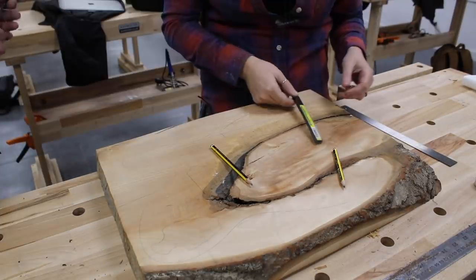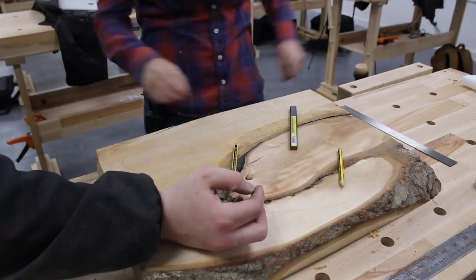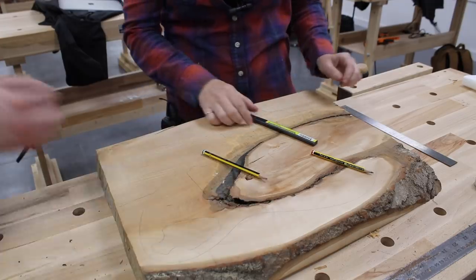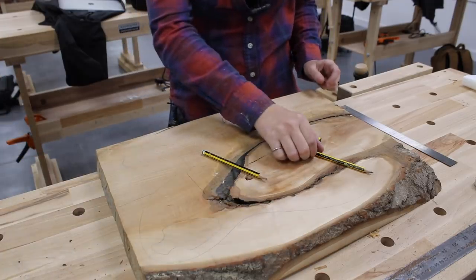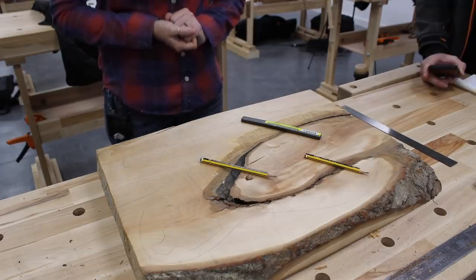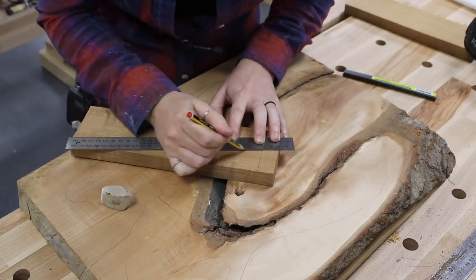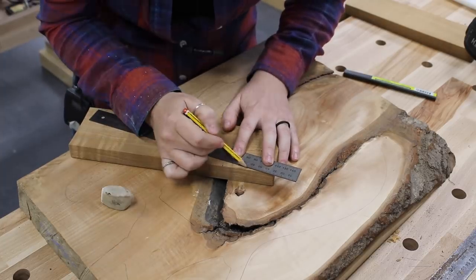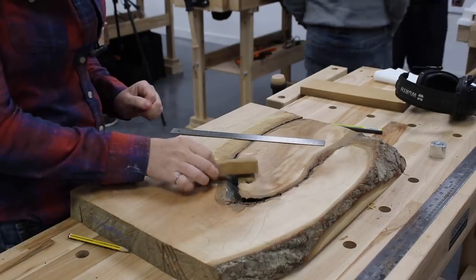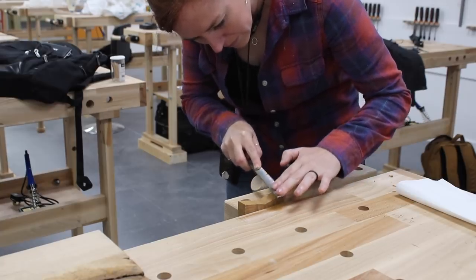After tracing on my body shape I roughly figured out where I could place the bow ties and how large they could be without interfering with any of the guitar components, but still in positions to do their job of holding together the crack. Once the direction and general size was sorted, I drew it out on a piece of roasted sycamore — the same wood as the neck of my guitar — then cut it out over at the bandsaw.